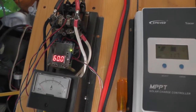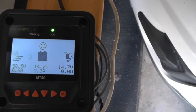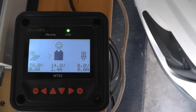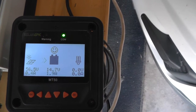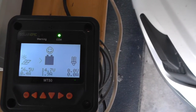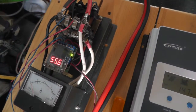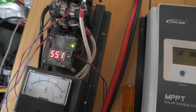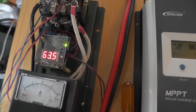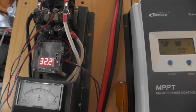When that gets to 75 volts — because the battery is coming up 0.6 amps at 58 volts, and the battery is at 14.8 — it just changed again. When that controller decides that the battery is up, the voltage, it disconnects and the voltage goes up. It should switch to the dump load, which it just did.